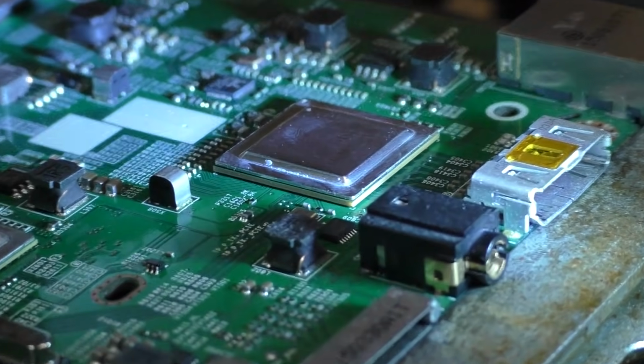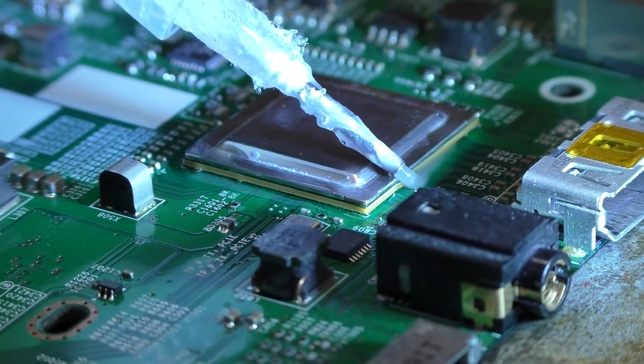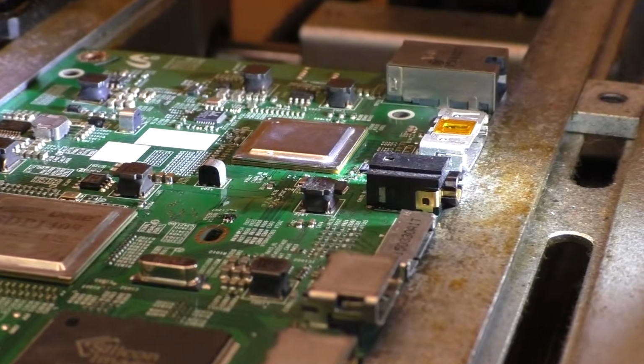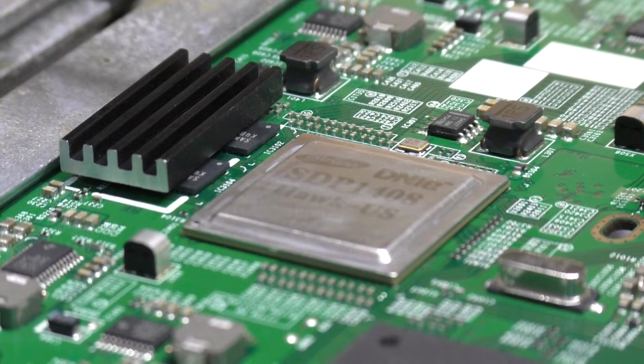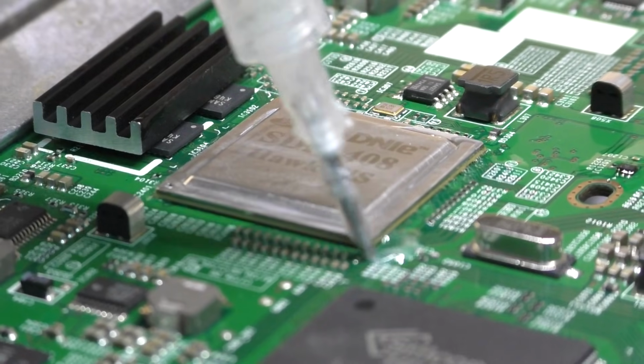We've just skipped ahead to the second chip. We're already 2 minutes into the profile and are adding the flux. We've now reached the solder's melting point for the second chip and are ready to prod. This one you can more clearly see the movement, which again confirms we reached the solder's melting point and thus have properly reflowed it. We are now skipping ahead to adding the flux for the third and final processor chip.